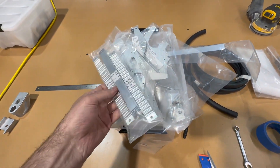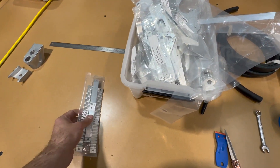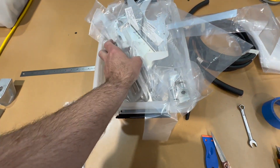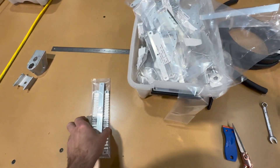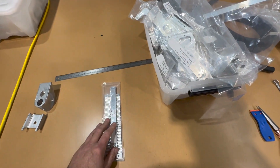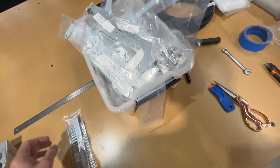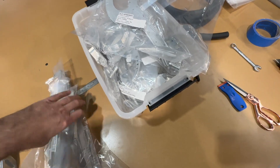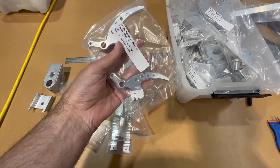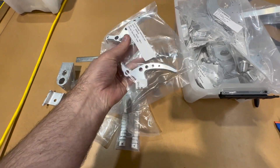I've removed from the kit and identified certain aluminum pieces that I'd like to have anodized. There are two different types of anodizing process I'm going to do on these. I'm going to do a type 3 hard coat on certain parts and a type 2 cosmetic anodize on others. An example of where I'm going to use a cosmetic is something like the door handles — just a type 2 black dyed cosmetic anodize.